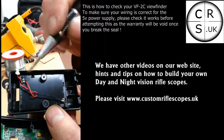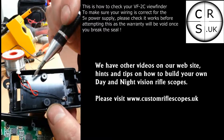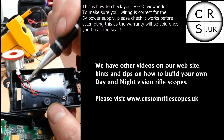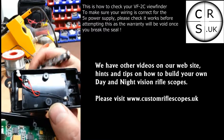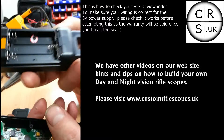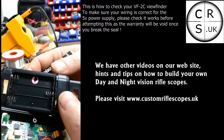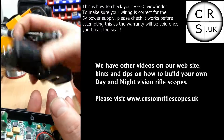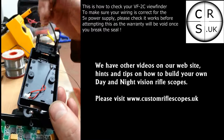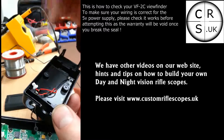So if you take this apart, desolder the wires, carry on with your project, and then solder it in thinking that the red is the positive when it is not, it will go pop. So always make sure you check the back of these. This one you can see is actually wired up wrong - well, it's not wrong, the colours are just wrong. I hope that helps.